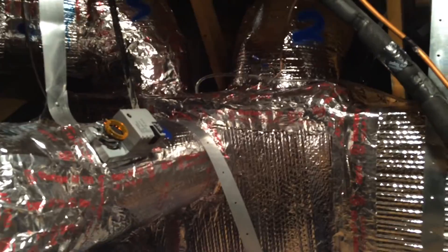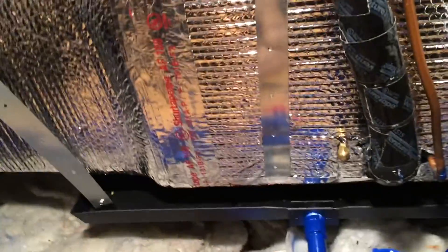Great system — zone panel up there. I think the most amazing part, what really impresses me about the Platinum ZV when paired with a zone system, is the static pressure. Here's the tube going into the supply plenum. We got temperature sensors in the supply plenum. Then it goes over here to the return — there's the tube going to the return. So it's adjusting itself and sizing its zones, deciding how much pressure to give each zone based off static pressure, which I think is a game changer and where the future's at. That's really cool to me.